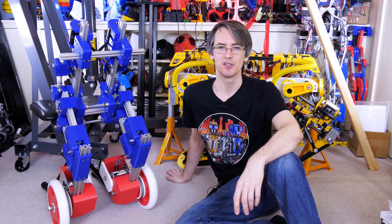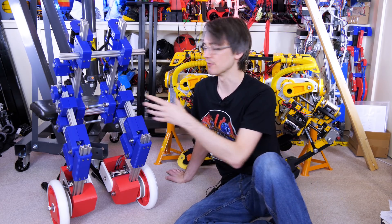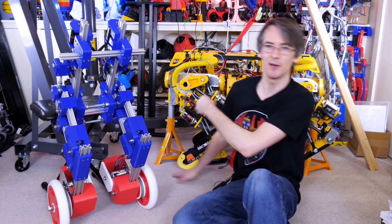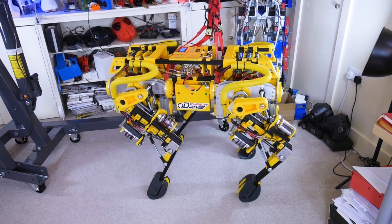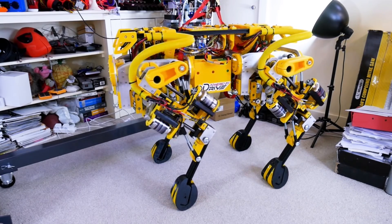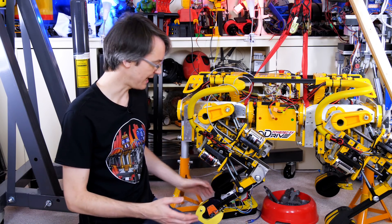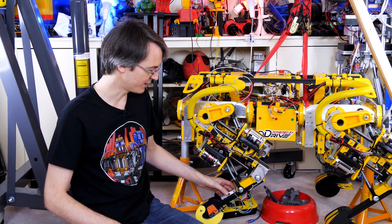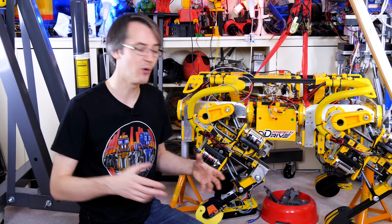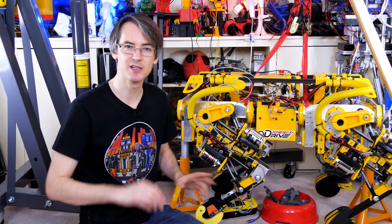At the beginning I mentioned this robot will have suspension to absorb loads over bumps. But there are no springs — the mechanism is pretty rigid with ball screws that can't be back-driven. The solution relates to OpenDog behind me. On OpenDog we added a test foot with a switch to detect ground contact, plus a load cell attached to the aluminium extrusion to measure deflection and pressure on the legs. That was an attempt to get an elastic effect out of the rigid actuators, making it more forgiving when balancing and ultimately more agile.